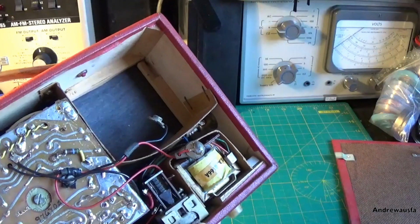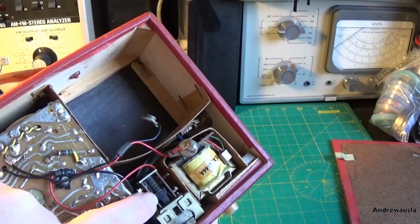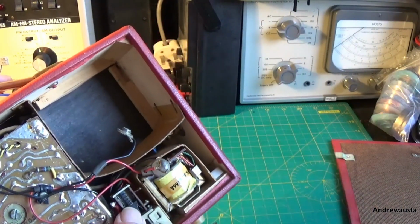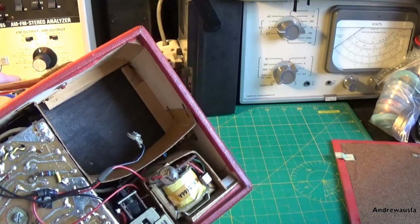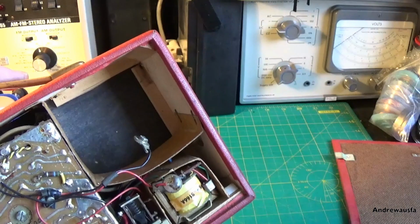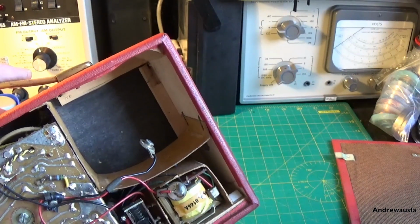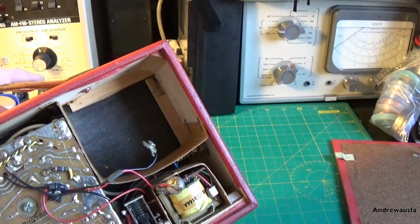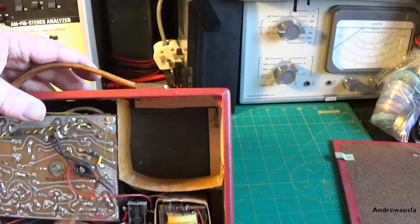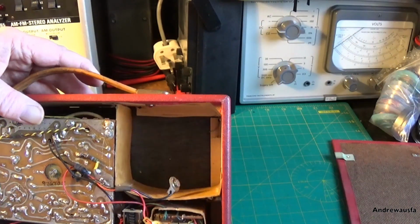When the mains lead of whatever sort is inserted, it has a little spring contact there. You see it springs apart as this bit rides up. It doesn't spring apart very well. Well, it sort of does. So that must be the battery cut-off. We've got a 9-volt transformer, I guess, there. And we've got an NKT transistor used as switching.